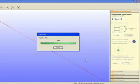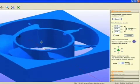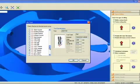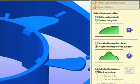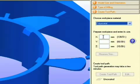Roland's easy-to-use SRP Player wizard-based software will walk you through the process of defining the material to be used and selecting tools for your model. Import your model and verify its dimensions. If you don't know what tool to use, SRP Player will guide you through the tool selection process by asking you a few simple questions. It will also ask you what shape material you plan on using. You select the type of material and the dimensions of material you have available, and SRP Player will select the appropriate tool to create your part.